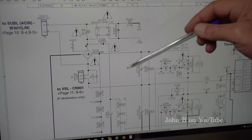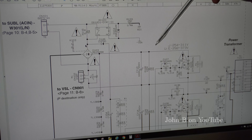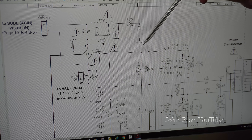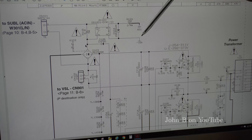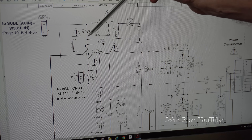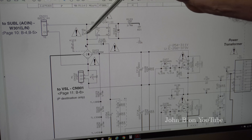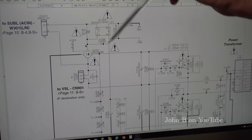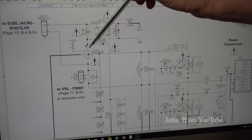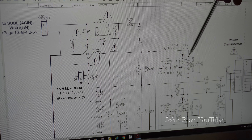The mains comes in here. So this relay is controlled by minus 15V — presumably a minus 15 volt regulator. I only saw one minus 15 volt. That's an analog ground. Diode across the coil to stop any back EMF flowing back. So that relay has to switch on to give us the live, but all the time it's not switched on and we've got no 15 volts — we get 240 volts through here into the rectifier. But just to get the switch mode power supply going, we should see roughly mains voltage on these FETs, and I've got nothing.